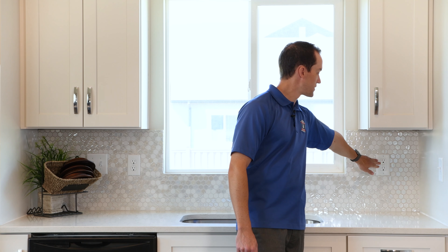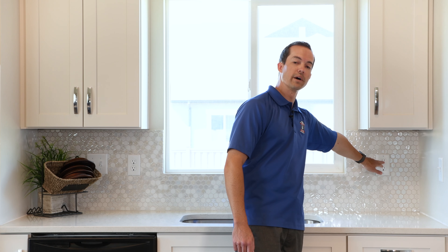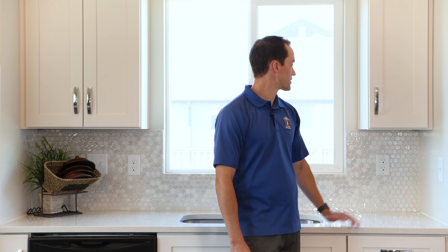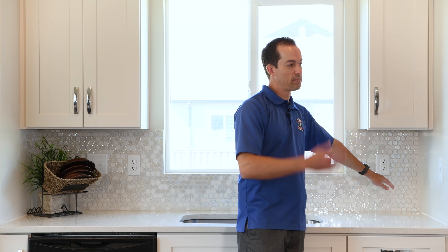There's going to be more than one outlet connected to the GFCI reset outlet. You find which one is tripped — and when I say tripped, I mean when it's off you'll see that the top reset button on the outlet has been popped out. So if the outlet on the other side of the kitchen is connected to this circuit right here, then there won't be any power there.